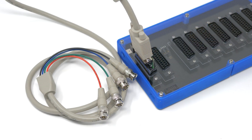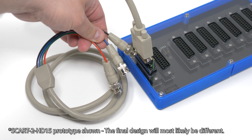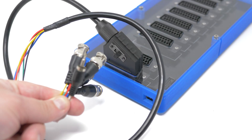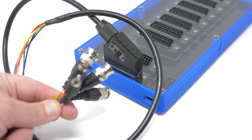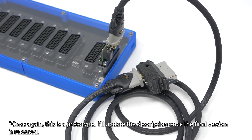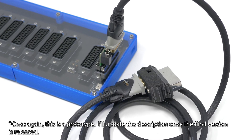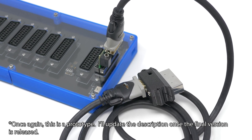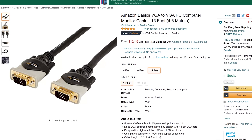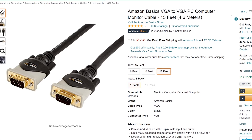Let me show a few examples. First, if you have a SCART switch, you could use this along with a cheap VGA to BNC cable to send video to your monitor. Depending on your setup, just buying a SCART to BNC cable might be a better option, but this option's here if you need it. Next, maybe you just want to use a VGA cable to go from your switch to your SCART device. It's always best to keep your analog cables as short as possible, but sometimes that's just not an option. In that scenario, it might be cheaper to get both of these adapters and a long shielded VGA cable as opposed to buying a long shielded SCART cable.